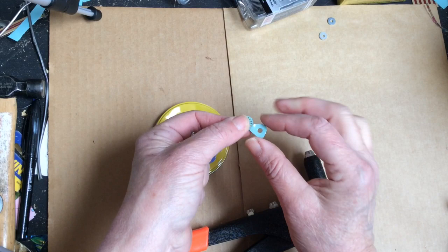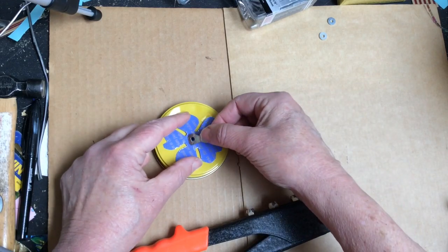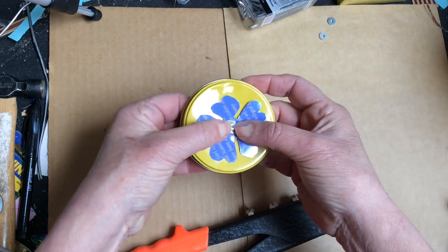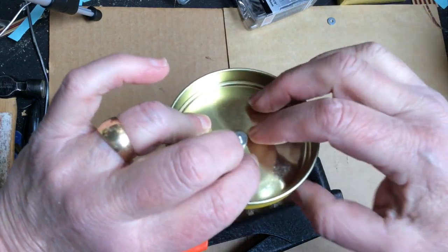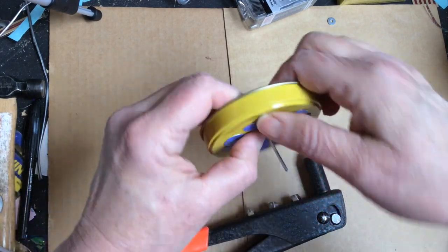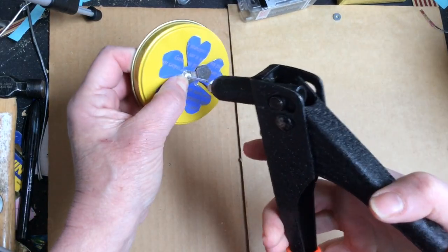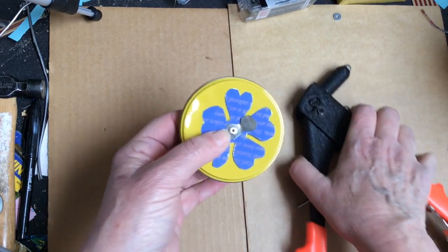I cut out a circle with a tab, and I put a hole in the tab right in the middle with my Whitney punch. Put the pop rivet in, make sure it's all the way in, and then take a steel washer and put that over the end for a super secure connection. Then take your pop rivet gun, and with the handle open, stick the nozzle all the way down the end of the mandrel and squeeze and release.